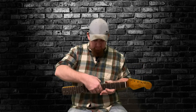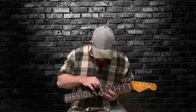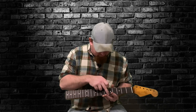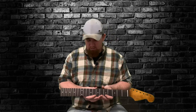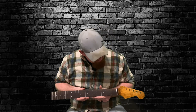Pretty easy, pretty self-explanatory. The only thing I have to do now is actually age the dots and we did darken the fretboard a little bit. I do got to do a little bit of touch-ups because I did get a little bit of shellac on my finger and touched it. Thin shellac is easy to sand out, and that's why I like working with shellac - it's durable and it gives it that nice lacquer look.